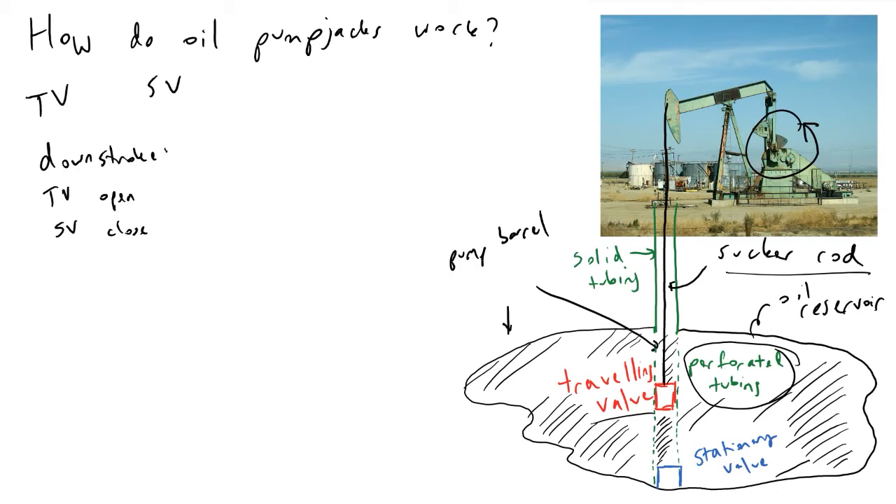When we get enough pressure inside our system, the thing to remember is that our goal is to increase the pressure inside of the reservoir, because the more pressure we can get, the more fluid will flow into our pump barrel. That is the goal at the end of the day — reservoir pressure increases, and then on our upstroke, oil enters the pump barrel.